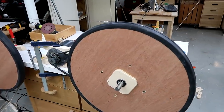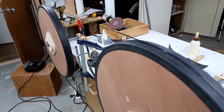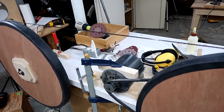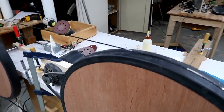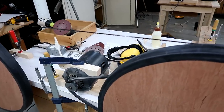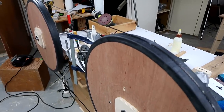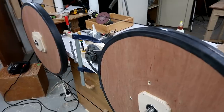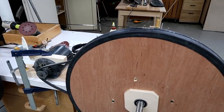Why did I make the wheels hollow to make them lighter? A heavy wheel could potentially stabilize things a bit if the motor is underpowered and you ram material in — it takes longer to stall out. But you just shouldn't be doing that; if your motor isn't powerful enough you just need to cut slower. That momentum is actually harmful because the saw takes longer to spin up and, more importantly, longer to spin down after you turn it off. Years ago there was a company called Steel City Tool Works that made a bandsaw with granite wheels — I couldn't think of a more stupid idea.